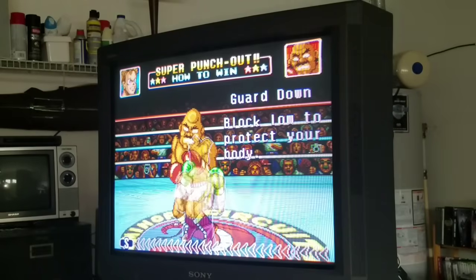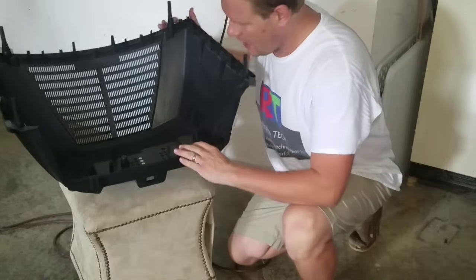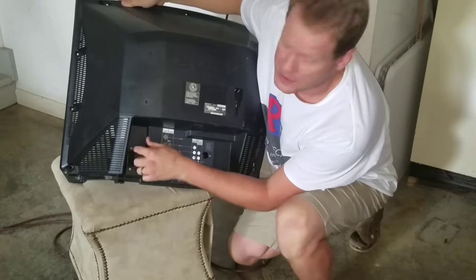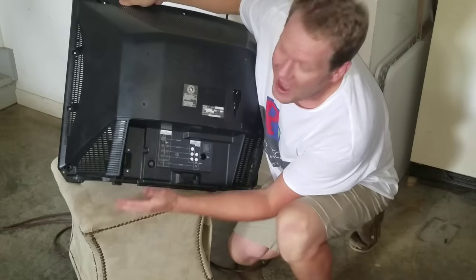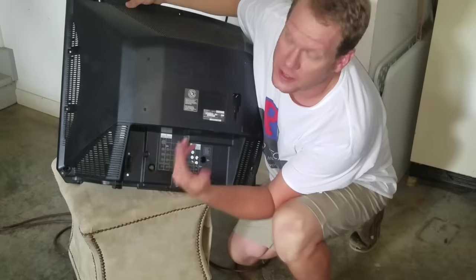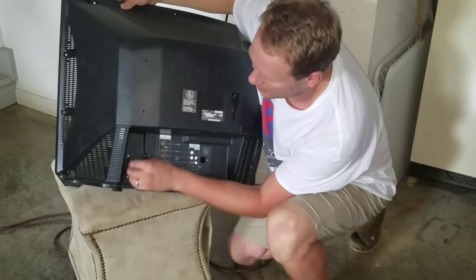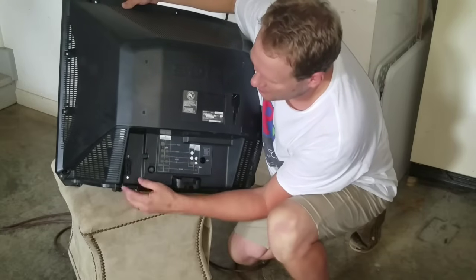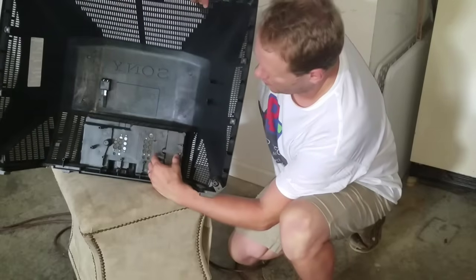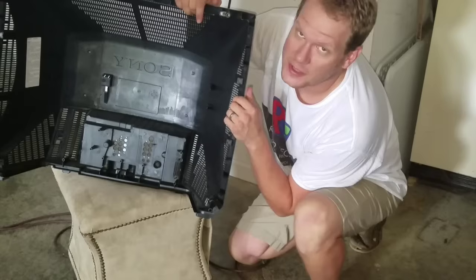There's only one more thing to look at, and that's how to mount the SCART input. I'm back here at the back shell for the TV. I measured out and mounted the SCART input right here. I had to use my X-Acto knife and hand-cut and shaped it a little bit larger than the input, then used some small screws. I did not have to use my drill on this case at all. The plastic is very soft and as you work it, it'll just come apart easily. It won't chip — but it will chip if you use too much power with a drill probably. So for soft plastic, use hand tools if you can to cut it.